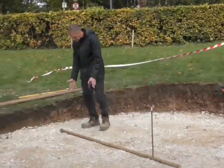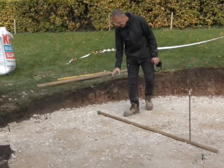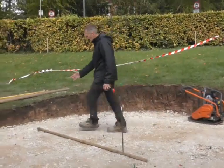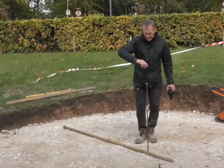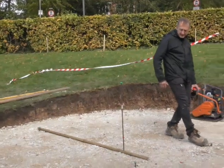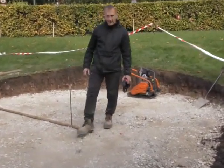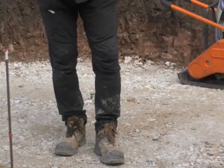This is where the seat is going to come to and then a slab will go on top of that. It's a circular kit which will guide us when we come to lay the paving. I've got to make sure that where the drystone wall comes up it's exactly just over two metres to allow for the circular kit. I'm going to give it a final wacker — there are some pegs in here. We're keeping it fairly tight to the slabs, so there'll be about 25mm of mortar and then the slabs, and we should be up to height.